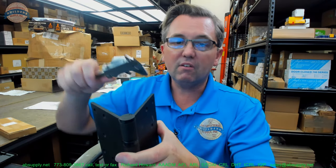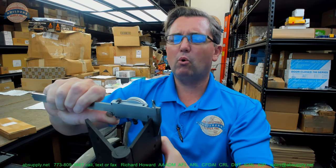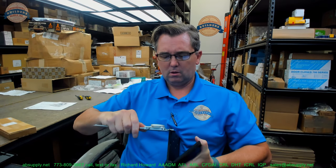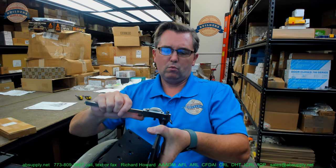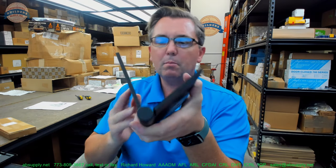The thickness of this leaf — this being a 4B21, a 4 in the part number — my caliper tells me it's 0.19 inch. I would have expected this to be thicker. The other leaf is about 0.197, 0.193, 0.194 — so it's not perfectly parallel. I would have thought this hinge would have been over 0.200 inch.